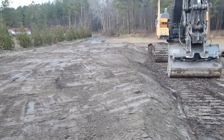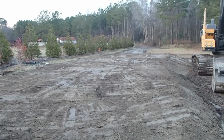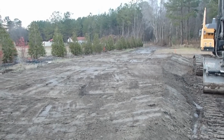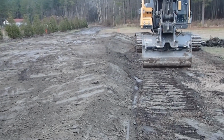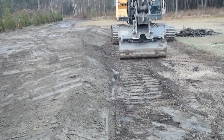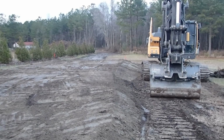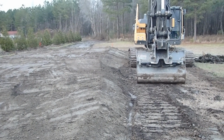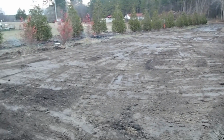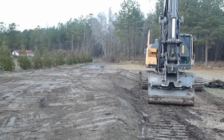Need a little bit more right there in the center. It kind of bows in just a little bit, and down there on that end. So probably one more dump truck load of good screen topsoil will finish that off, and I'll take what's left of some junkier topsoil around here, and I'll build my slopes out around here to soften the slope just so it doesn't erode and a little easier to mow and maintain. That grading bucket sure does make quick work of stuff like this.